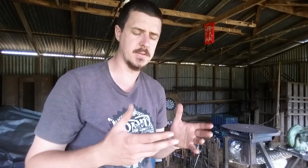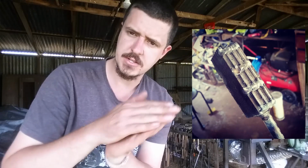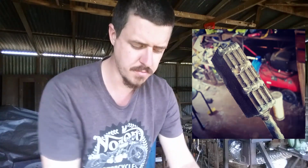Now, this is only going to apply to certain styles of damascus billet. There's two real, main styles. There are stacked billets with tack weld lines around the outside to stop it from warping open. And then there is the style that is popularized by master smith Kyle Royer, where the entire billet is sealed. He'll actually put sheet metal around the edges and seal the entire thing.